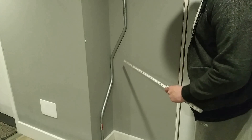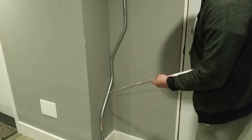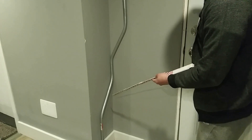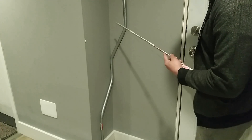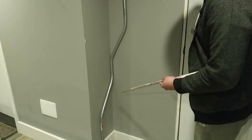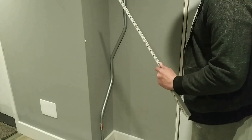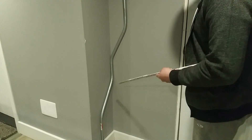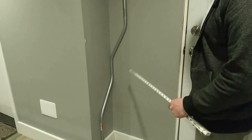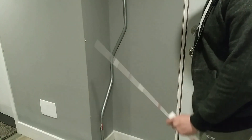The first offset can definitely be a different size. Let's say you have a four-inch offset on the bottom — the top offset does not have to be a four-inch offset as well; you can use your discretion on that. Also, these are offsets, so you might want to take shrink into account — that's something you're going to have to figure out. So this is the corner offset — the inside corner offset. I'll be coming out with more videos soon.